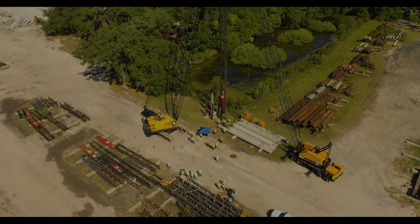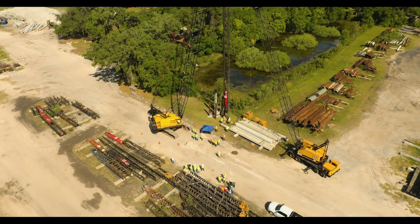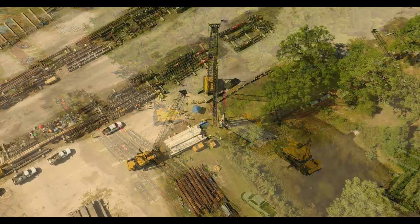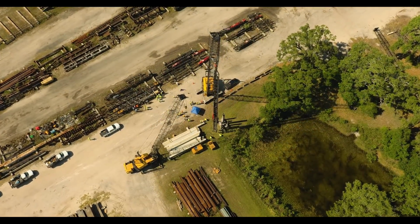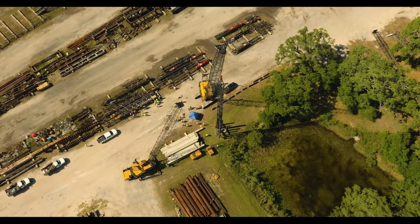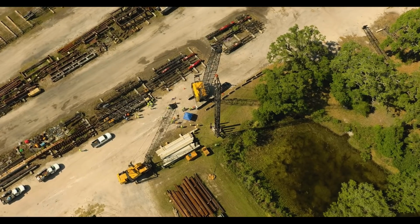Due to the melting of the hammer pad from the D36 hammer and the real-time piling data report, which to this point showed no significant changes in the stress wave pattern of the piling or to its structural continuity, the decision was made to switch hammers to the larger D62 in an attempt to cause the piling to fail.